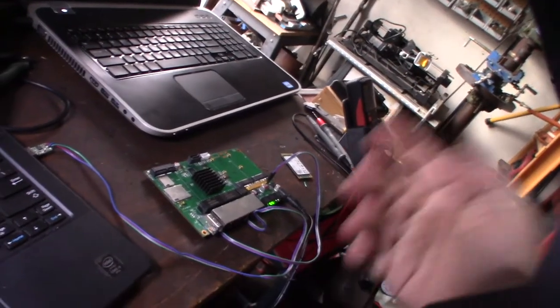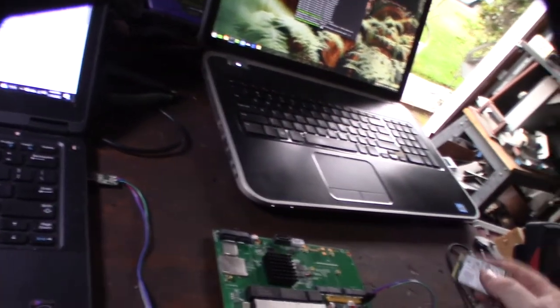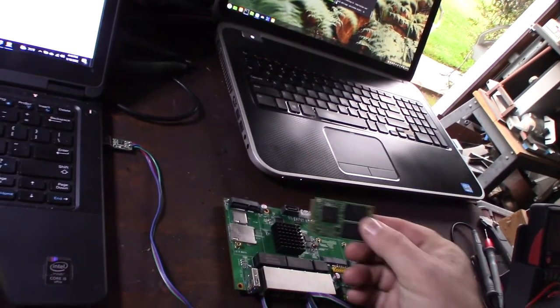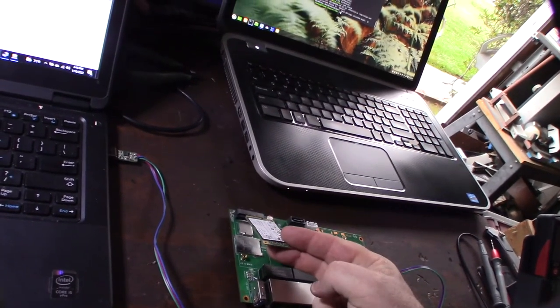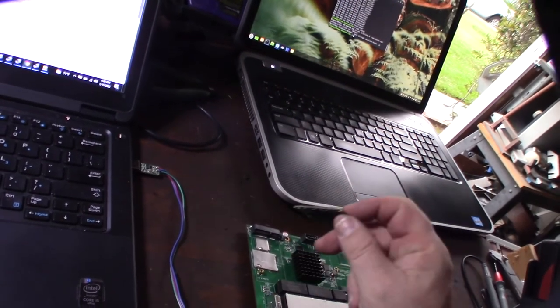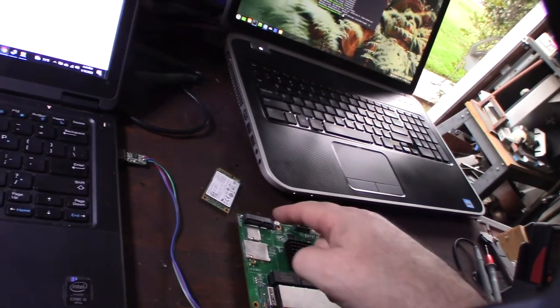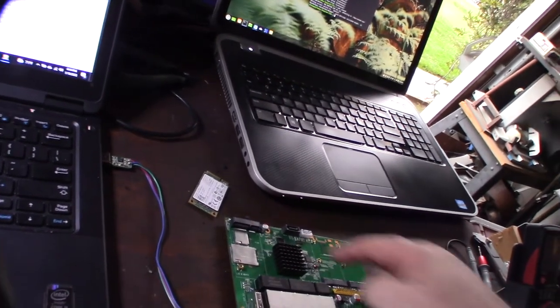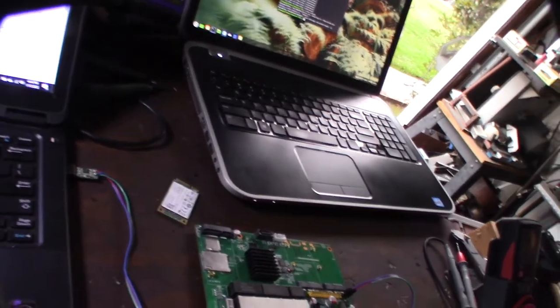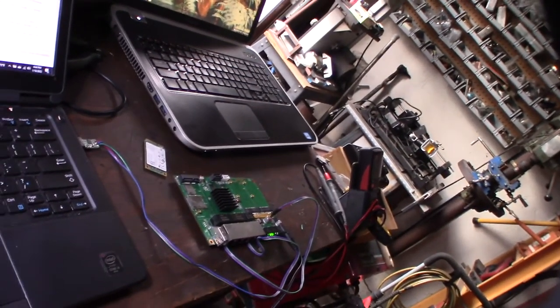That's it for this video. I made a couple of console cables, got UART connected. The whole point was because I wanted to hook up this mSATA flash and have it boot from that flash — copy an image to it and boot from it. The cool thing about this board is you can boot from mSATA, onboard flash, or micro SD, so it'd be nice to know how to do that.